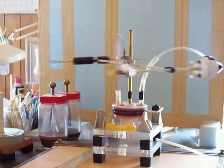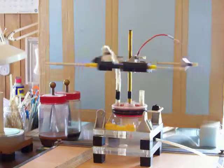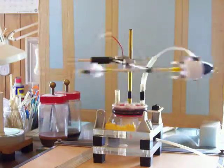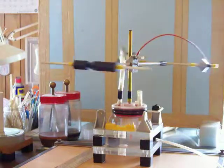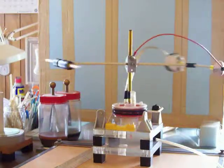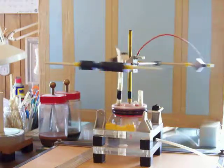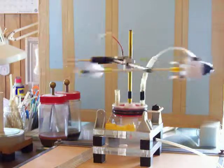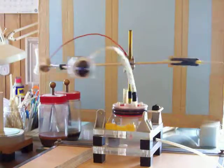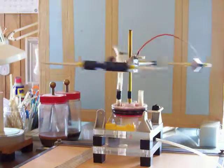You can see it turns every bit as fast as the comb-shaped design, but in a much smaller concentrated area around the emitters themselves. Now, if you see this in the dark, there is quite a class II discharge on the emitters that extends about an inch visibly beyond the end of the emitter. With the drier air, you've got to be very careful. Getting the power from the generator to the emitters without causing any type of class I, class II, or class III discharges is real difficult.